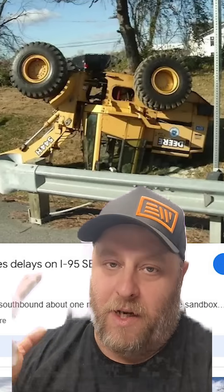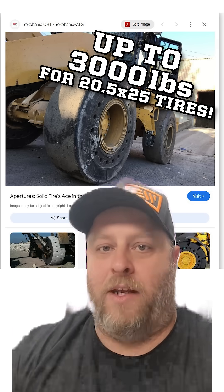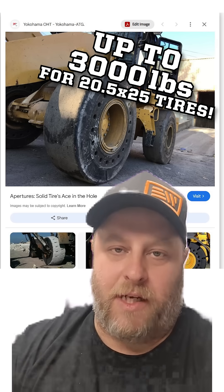Why we need to talk about this is when it comes to airless tires. The majority of airless tires in the market are really heavy — way more than a radial tire and rim — so they have to go on machines that have a higher ROPS-rated cab.